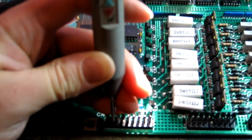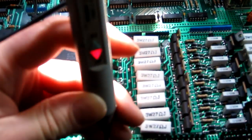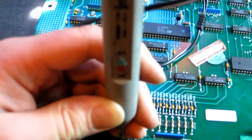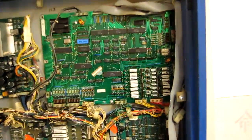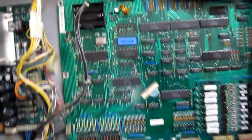These transistor outputs where we've just replaced the two transistors are all looking good. Looks like we're all fixed — at least enough to go and put it back in the game now. That's the board back in my Star Wars machine. A customer also asked for the 20th Anniversary software upgrade, so I've burnt the ROM for that and it's installed. I'll just fire it up and see what happens.